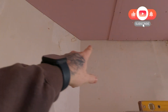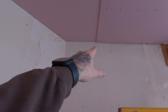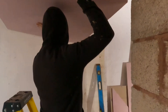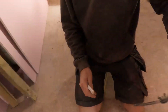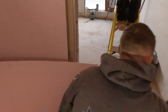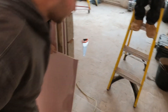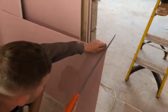To get this angle here, we're using a tool called a bevel. Parker measured from the end of the board to that corner, used his bevel to get the angle, drew it down — lovely fit. He's using a level to extend the line through. Out there on the floor, he uses a hand saw to cut — it's a lot nicer because the fire board is a lot denser than standard board.